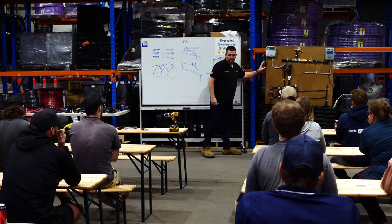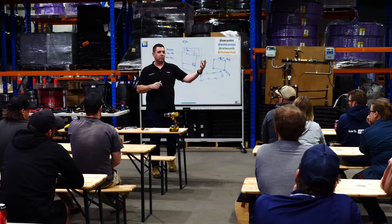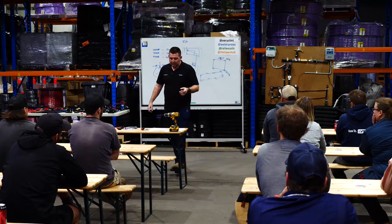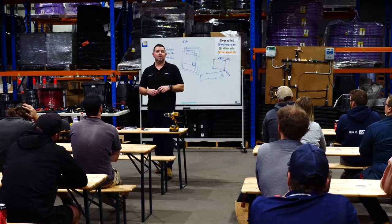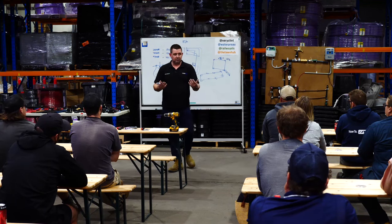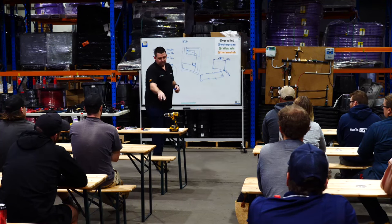What I had the guys do is build this board - this is the first time we've had the board for a training session. I wanted to be as visual as possible and as hands-on as possible. When you've chosen to put sprinklers on the lawn and drip tube in the gardens, you can run that system off an irrigation controller with a solenoid valve, a manual ball valve, or something in between. It really depends on how much money the client wants to spend and the accessibility of the property.